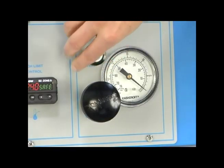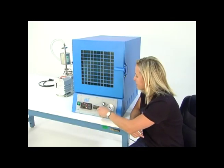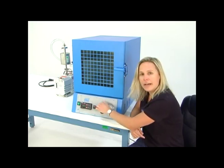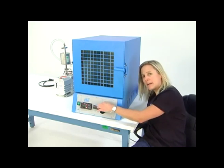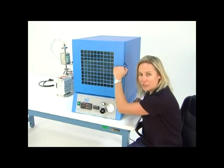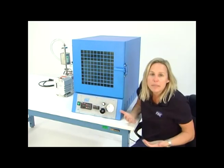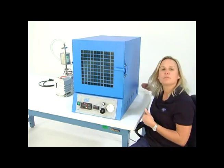This little vent valve allows you to vent. So let's say that you're done with your process — you've got a vacuum inside the oven — close the vacuum valve, open the vent valve. This allows air from the smaller quarter-inch connection in the back to flood back into the oven. The pressure equalizes on the inside and outside, and you can open the door. Some people like to backfill their oven with nitrogen or argon, some kind of inert gas. If you want to do that, you can make the connection at the back of the oven and that'll work fine as well.